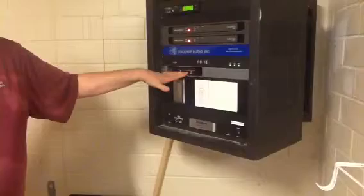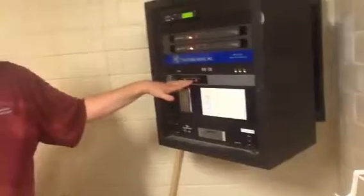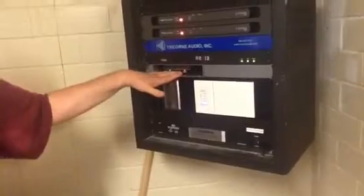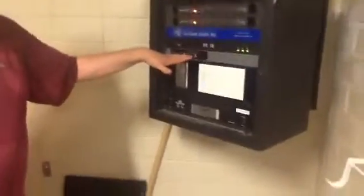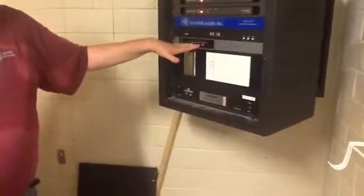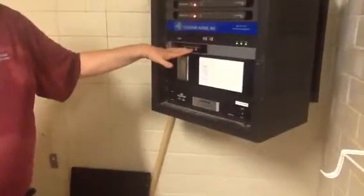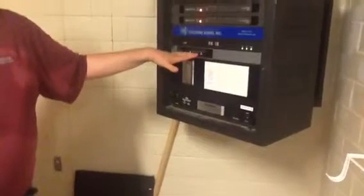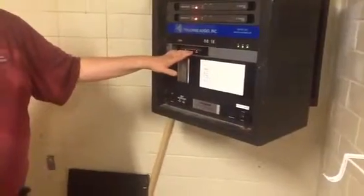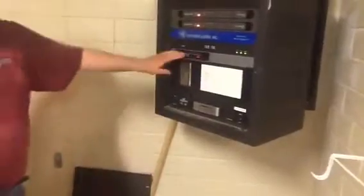I speak from personal experience. I used to be a technical theater director at Morehead Schools for 8.5 years. We had that happen to us. It was not a pretty sight. I can promise you that there was a splitter in there by the next school year. Essentially what happened, we had a piece of accessory equipment in a lighting instrument. We had borrowed the instrument, it wasn't ours. Didn't think, why would you check the plug? I mean, they'd been using it. The ground was lifted inside the plug, but the hot was still there, and it used the accessory as the ground path right through the DMX control. It wiped out 2 outputs of our board, wiped out the accessory, and the power supply for the accessory. So I put these in faithfully now.